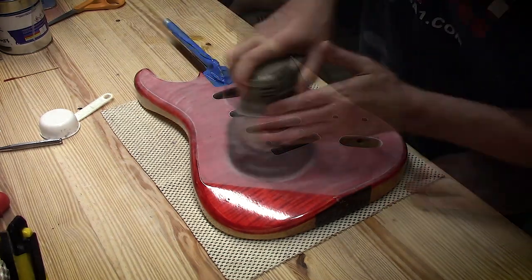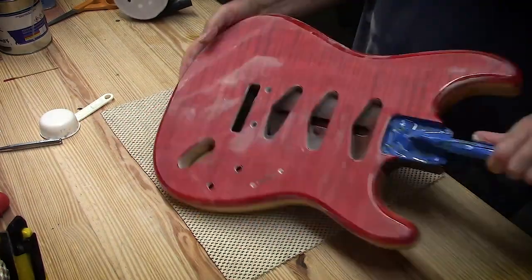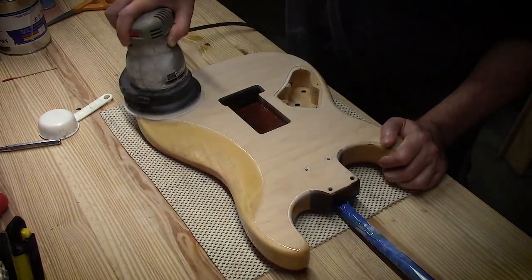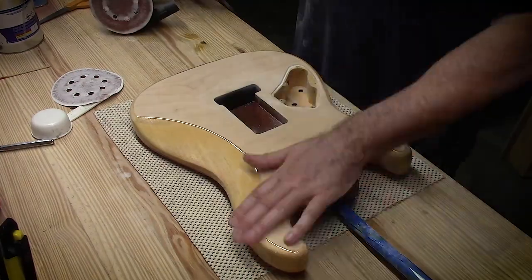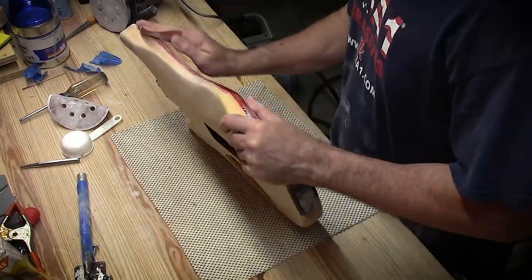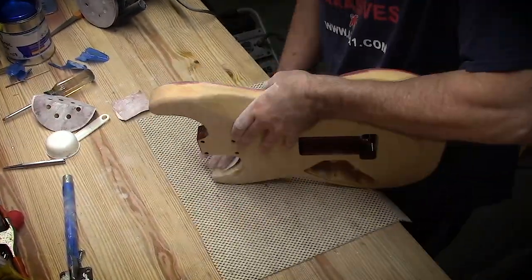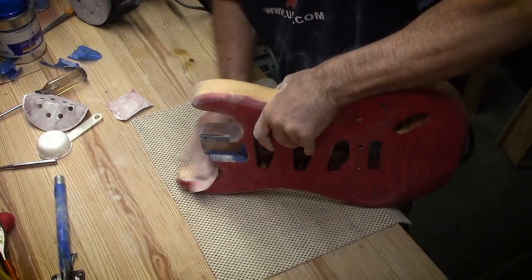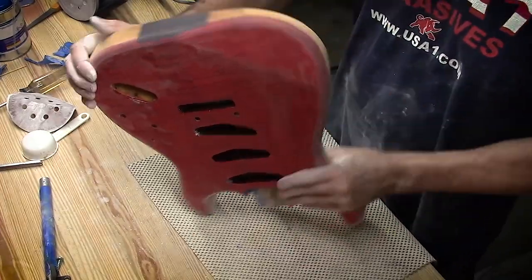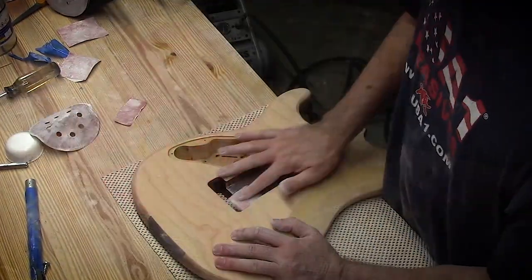More sanding to be done on the easy sanding sealer, which goes pretty well. Using the hand palm sander, it leveled out really well. I was actually thinking I'd have to respray after this sanding — give it one more coat of sanding sealer — but it turned out really well. There was one little nick where the top veneers were put on, and I was able to fill that with sanding dust and CA. So no need to reseal the whole thing for one small issue that was easily taken care of.